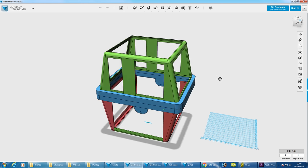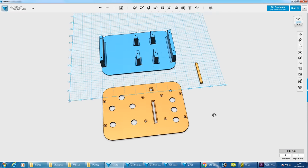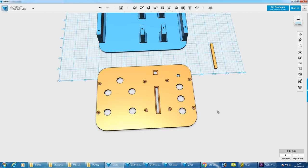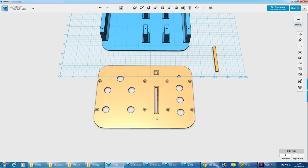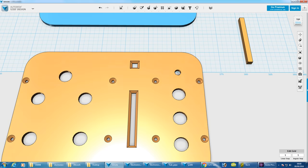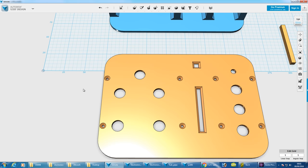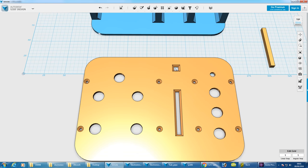We do have a ninth motor on the waist axis, but that's going to have its own motor driver mounted near the motor. We also need a remote control — all we need is buttons really. There's one slide pot for altering the angle of the box so we can set it as it walks, and it will dynamically change its angle to balance as well — that's a nice puppeteering feature. We've got a toggle for motor enables, three buttons for sounds, some control buttons for walking forwards, turning left and right, and two spare ones. I've also left space for a NeoPixel for an RGB status LED.